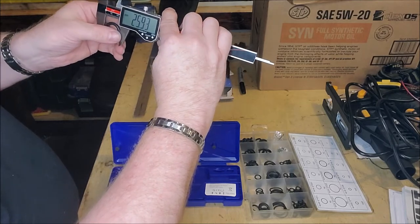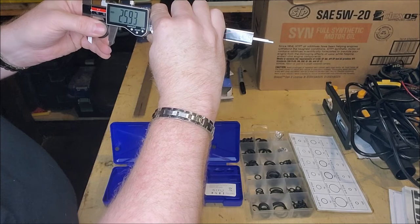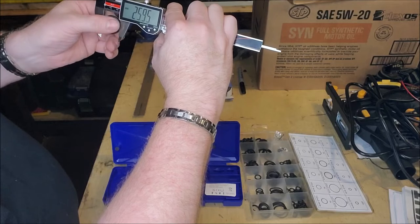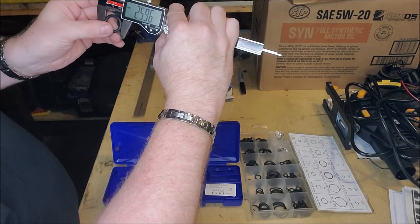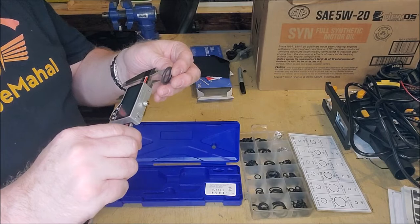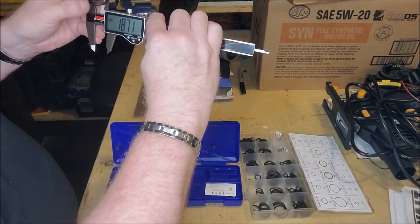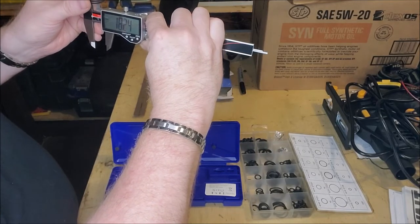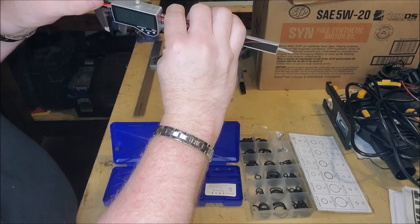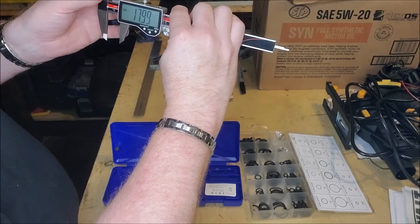You want to measure so you don't crush. So this thing is super accurate. And it's rubber, so you're going to be off a little bit. But you see, that's 26. And if I were to get it out to 26 exactly, you would see how it can slip in there pretty easy. And then you can measure the inside width of an O-ring without stretching it too much — it's actually 18. So you can see how it slips on pretty easy. And it's rubber so it's going to definitely conform to whatever shape you're putting around. So that's 18 millimeters — this measures that with great accuracy.